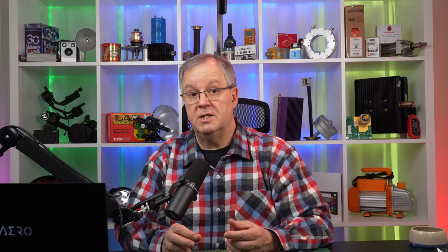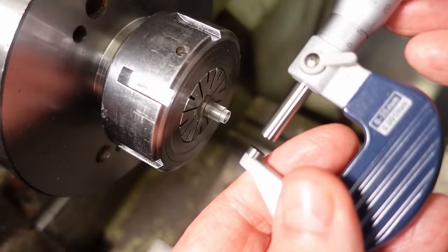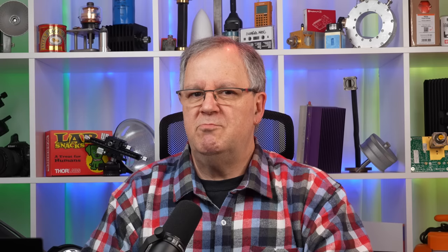I found that the best results were around 950 MHz, but because of licensing restrictions for transmissions in the UK, I had to do the demonstration at 1.3 GHz. That meant making a slightly shorter model for the demo to maintain the same performance. The external antenna rod is supported in a threaded polystyrene insulating bush, which keeps it rigid as well as being a good dielectric insulator. There are some interesting questions about how the material was sourced. I suspect it may have come from IG Farben, who among other things made Zyklon B, and were involved in technology transfers to the Russian state during the Molotov–Ribbentrop non-aggression pact that ended on 22nd June 1941. The material I used was from a donation by a subscriber — it dates from the early 1960s but should have identical properties to the original.